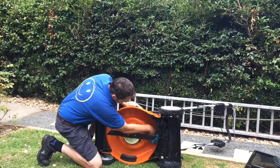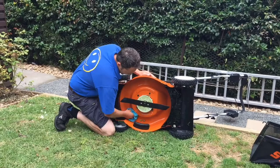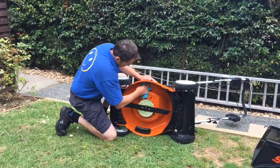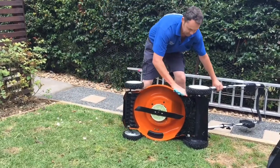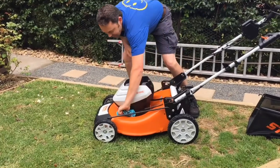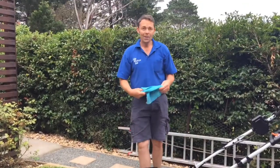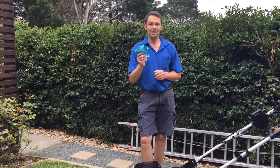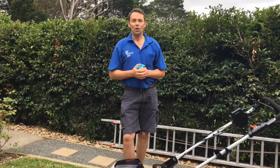You use a microfiber cloth that is damp and simply wipe the undercarriage out. I do this after every mow — it doesn't take long, just wipe the grass out and keep it clean. I used to hose my old mower out; now I just use a damp cloth. So for care and maintenance, just clean with a damp cloth, or maybe a brush if you've got a lot of grass up there.